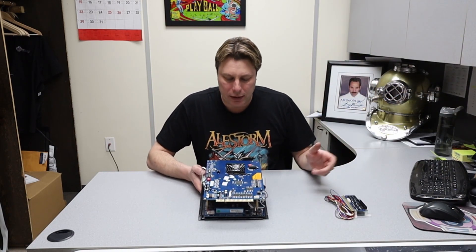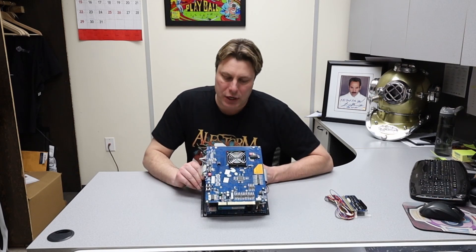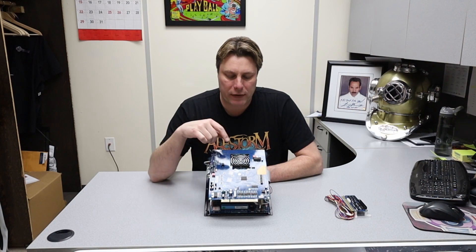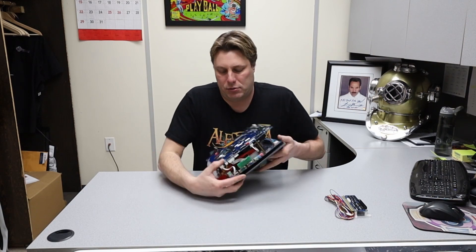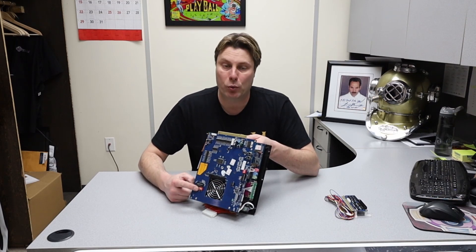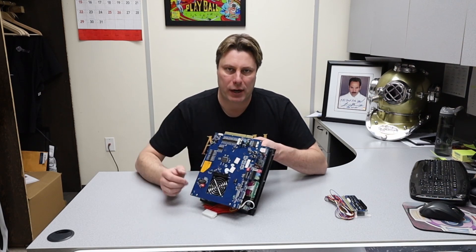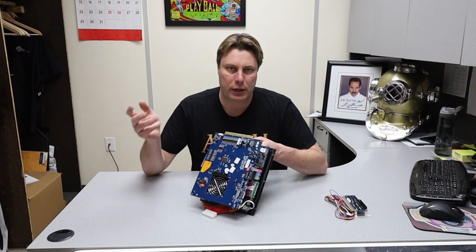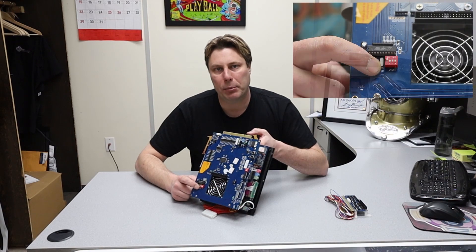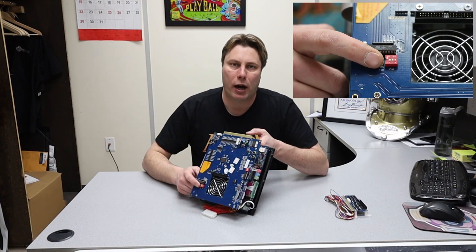That's the old style. If you want to see the new boards and how they're set up, check out my other videos for JAMMA boards, the 3016 and 2019s. To make sure everything is good, check your DIP switches. SW1 is the only one you'll really mess with — SW2 is just for credits, giving you one, two, or four credits per press. I always set switch number one to ON because it allows you to add credits while in-game, not just in the main menu.